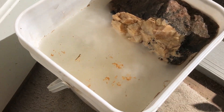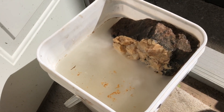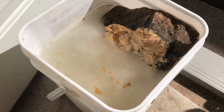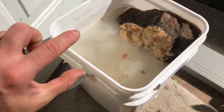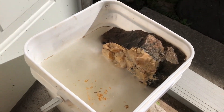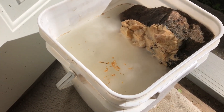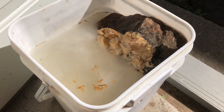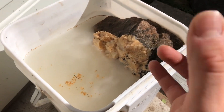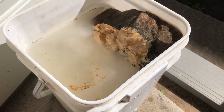You can see and hear it sizzling right here, so it's reacting quite well. You know the solution is fully saturated when the sizzling almost stops or totally stops. At that point, you can add more acid if you have space, or pour the solution out and add fresh water and acid to continue. My plan for this piece is to do a lot of acid etching from this part, then flip the piece over.